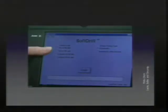Method 1 is my preference for manipulation: find wheel 3, 2, 1. That works 80% of the time. If Method 1 fails, or I determine that I have a lock that is going to be difficult to manipulate, I can go to Method 2. In this case, the software searches the entire wheel pack, and it might look for wheel 2 first, then 1, then 3. It's a longer process, but between these two, it's just about guaranteed to get the lock open. So let's see if we can get a go of it here.